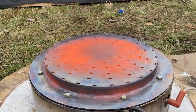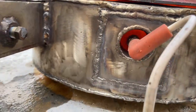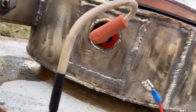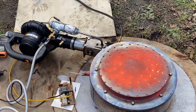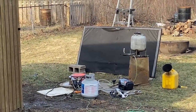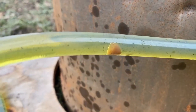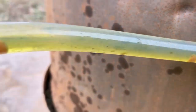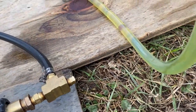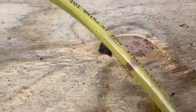I almost thought I was going to have to build a pre-burner and simply use this as a heat distribution system. We do need to insulate that area right there just a little bit — we're right around 700 to 900 degrees Fahrenheit, actually about 900 degrees Fahrenheit on that red-hot zone. It's broad daylight out so it may look a little brighter than it actually is. Here's a far-off clip to show that we are in fact not producing any smoke. My fuel tank is dirty — I shook it up and you can see all this junk flowing through; that appears to be a glob of water mixed with dirt and oil just rolling along in the tube.